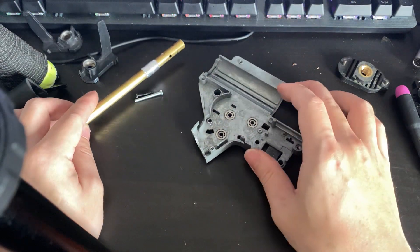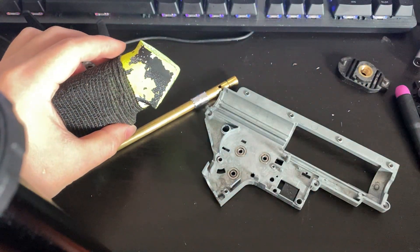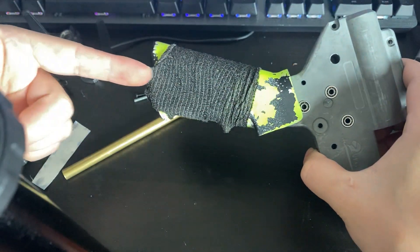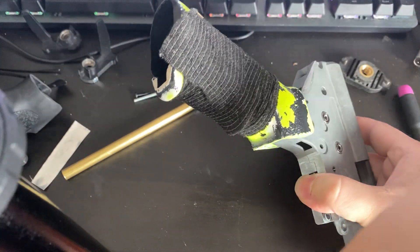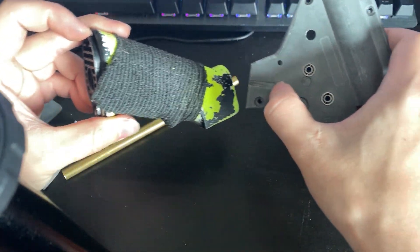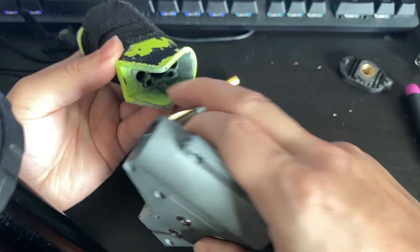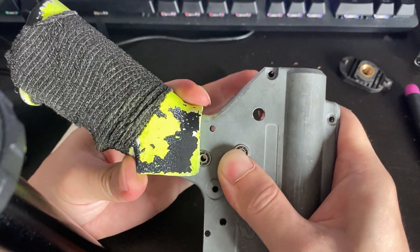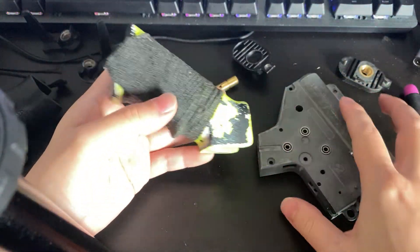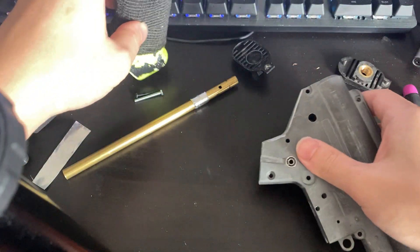What's important is I have to measure my grip. Ignore the paint — Portuguese law requirement. I put this in and I want to know if it's perpendicular. When I put in the butt plate, this hole is going to line up perpendicular — in line with this groove right here. This is a telling groove. First thing to check: whether your grip can shift. You have these two grooves and the groove on the gearbox, and sometimes they shift. This one is within what I think is acceptable, but you should check again once you bolt it on.